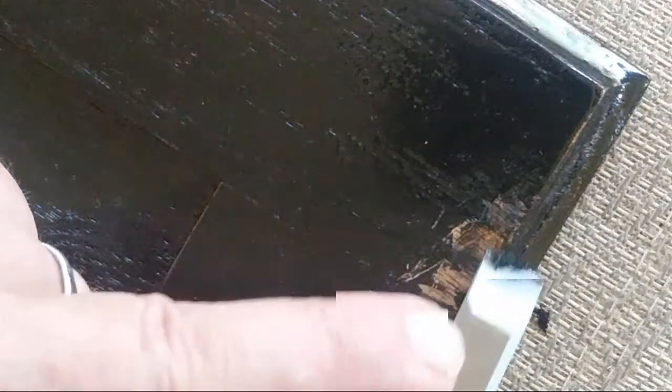I'm coming forward at a slight angle, and I'm exaggerating this so that you can see I'm coming forward and sliding at an angle. Now, looks like I've got most of that build up, that little edge here. And I'm catching now. It's almost like shaving with a straight razor. I'm on the sharp chisel to do this, of course. A dull chisel won't cut this way. I guess I should do a video on how to sharpen a chisel. You go in a figure 8 on sandpaper.